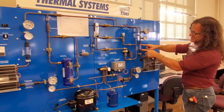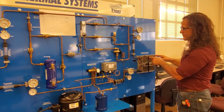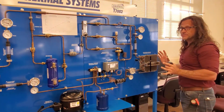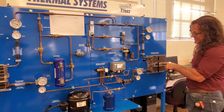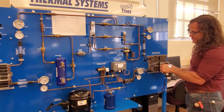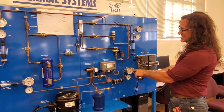Coming through here, we should see a mixture entering our evaporator. Our evaporator should be taking heat from the environment to evaporate the rest of it, so that we take this low temperature, low pressure mixture and turn it into a low temperature, low pressure, saturated gas.